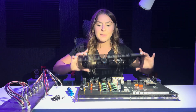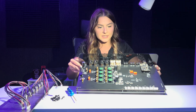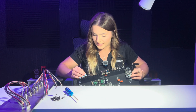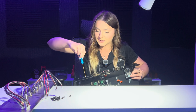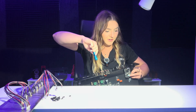To put the unit back together, I'm going to put the back plate on first as I find that easier — it slides in pretty easily. Take the back plate, match everything up correctly, make sure you add that little hook on there, then line it up. I find it easiest to put it on the XLRs just to hold it in place, then use your two and a half millimeter allen wrench and screw in just a few screws for now so it doesn't fall off while putting it back together.